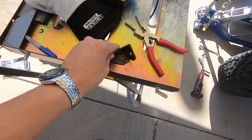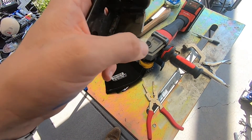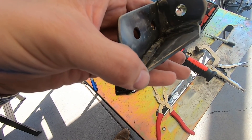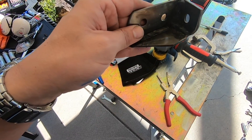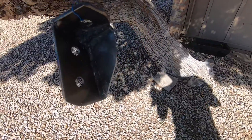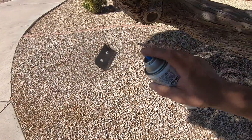And here we go — it's still not too warm. I did go in and wet it down. I will take a grinder and just smooth these edges over kind of like I did up here. I got a little hot back there as you can see. So I need to double check the fit, then I will get it painted and we will put it on. So there's bracket number one. I got some black Duplicolor rust barrier — it's just a black paint for bare metal. I cleaned this up with some parts cleaner. I painted it on my favorite tree. As long as my wife's not here to yell at me — didn't do too bad. Put a couple of coats on, let that dry, put one or two more coats on there. While that's happening I'm going to get started on the other side.